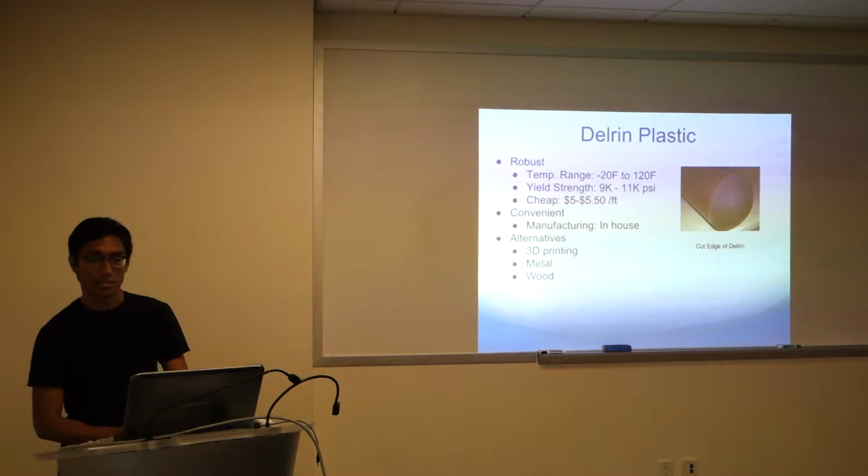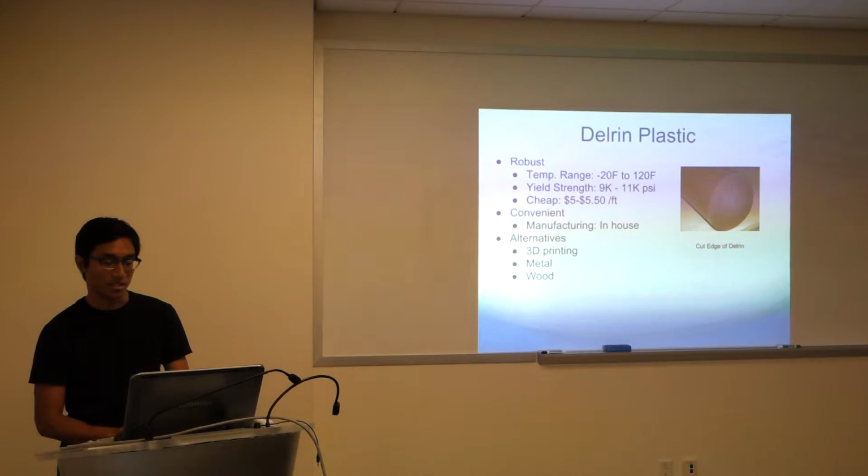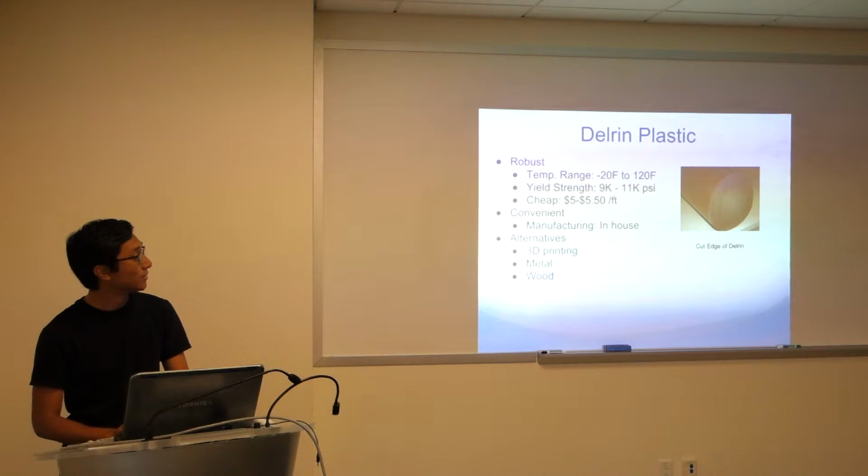I was talking about the material that we chose, Delrin plastic. It has a pretty high yield strength, between 5K and 11K PSI, and an operational temperature range of -20 Fahrenheit to 120 Fahrenheit. It's convenient. This is plastic. It was a bit stronger than wood.